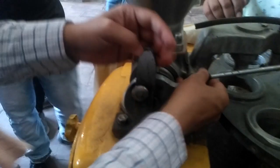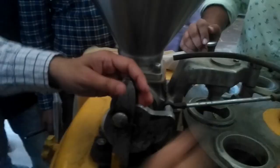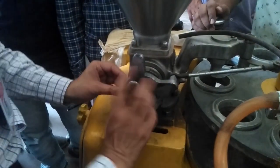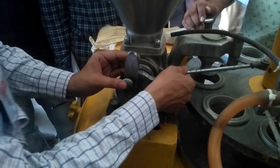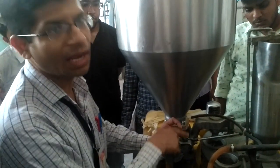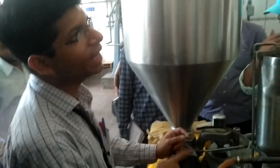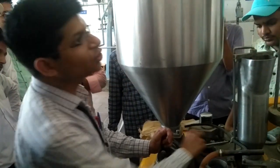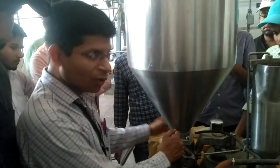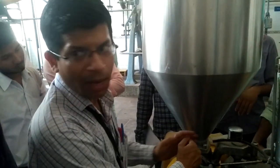Now coming on to this side here. We are having this crank and cam arrangement. When this rod moves during its rotation, it will be moving and pulling this cam in the forward direction, forcing this lever to move this part away from the nozzle. So the pump and this lid of the nozzle are synchronized mechanically — there are no two separate controlling elements, only one single control element. So the lid has to move away, and at the same time only the pump will start. If the pump is starting, this lid cannot be at the bottom of this nozzle. It has been ensured by mechanically coupling these devices together using this crank and cam mechanism.